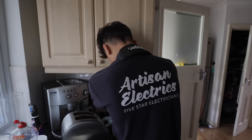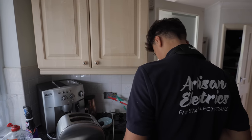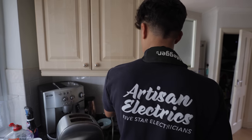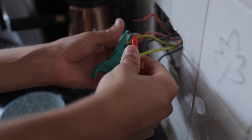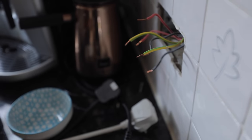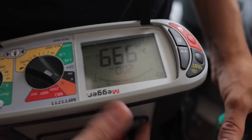0.63. What did you get there, mate? Well, I'm getting nothing on the earth. Sounds about right. What do you get on the lives? I got 0.63 on the line and 0.64 on the neutral. And then 999 on the earth. Yeah, for a second I was getting 0.4 or something. Oh yeah, must be the battery just dying out. Yeah, sometimes a battery symbol comes up on it.